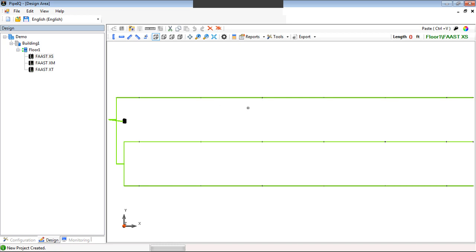And every single alarm threshold is going to be unique for that pipe network. So depending on the amount of pipe you have, the number of elbows, the number of holes, and the size of the holes all take into account what your hole sensitivities are going to be based on the alarm levels. And I'll show you what we've added as far as a tool.